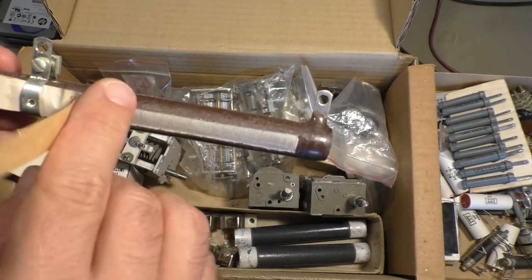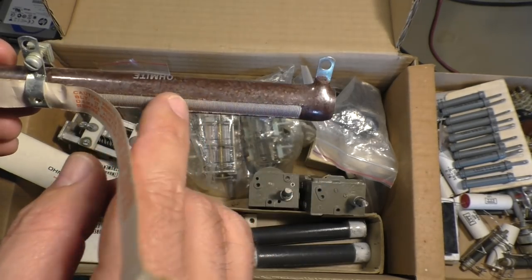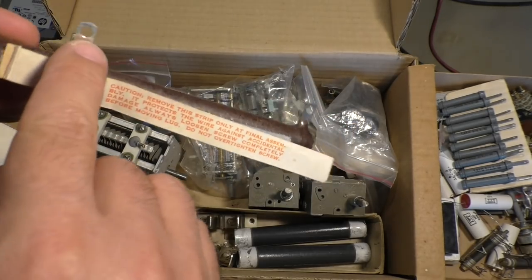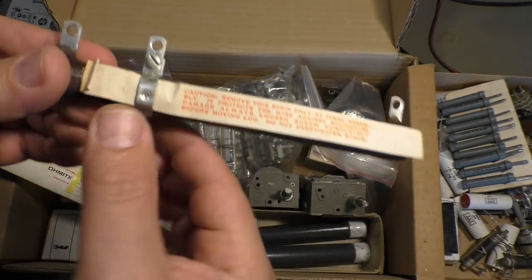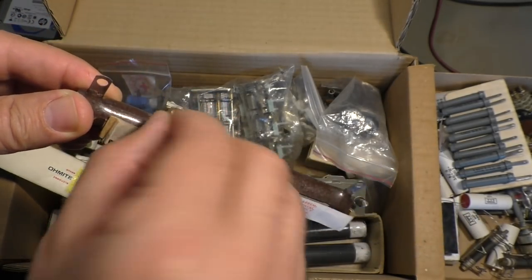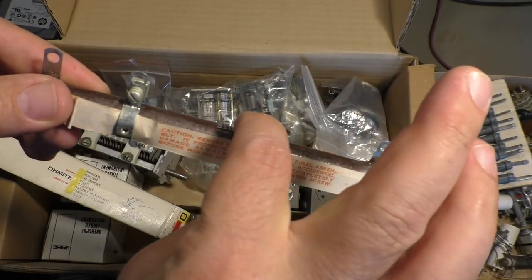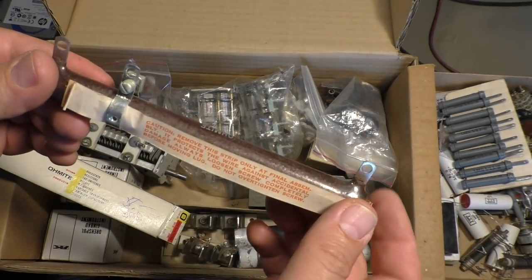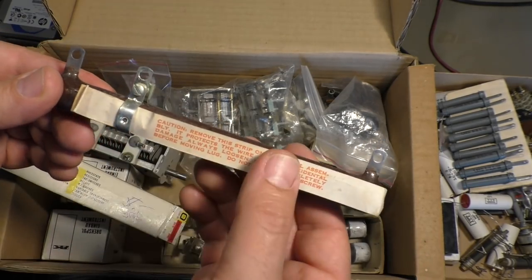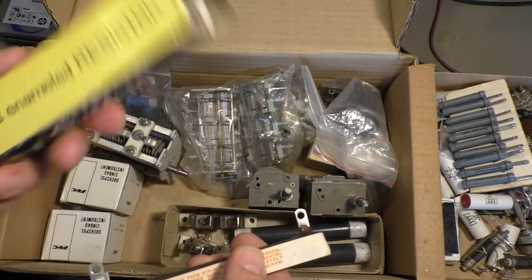It's a wire wound resistor with one side that is not covered with insulation material, and there is a movable contact. You can loosen the screw, move the contact to the desired value. It's like a potentiometer, but one that is only adjusted one time and then installed.